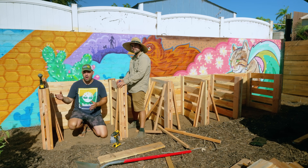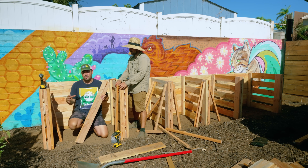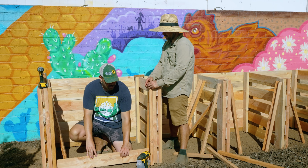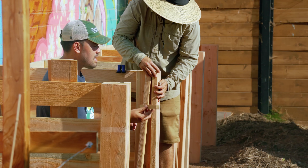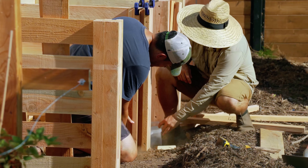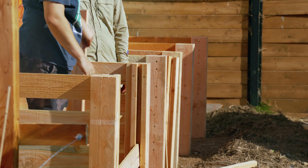The only thing we need to do now is put on the front panels, which are going to be solid to prevent material from flying out. We're using some two by twos to create a channel to drop in the one by six panels. You just drop them down and stack them upon each other. We created a one-inch spacer to make life easier, then clamped it down. Once a bin is finished, you just drop in these panels and they fall perfectly in place — they also help keep the rigidity of the structure.